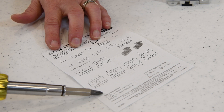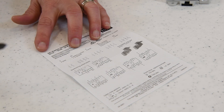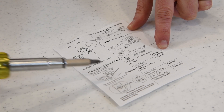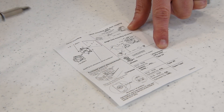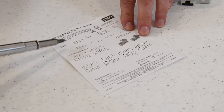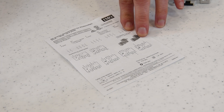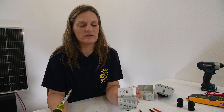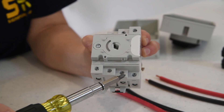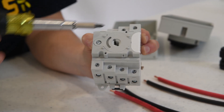You've got the cable sizes that you're going to use and the tools that you're going to be using. On the back you have some different mounting options, things about your enclosure and the environmental ratings. This is the most important thing for us today — our wiring diagrams and how to wire it up with your switching examples. As we look at the switch, this looks like the pictures in the diagram where we see the numbers are opposite: one, two, three to four, five to six, seven to eight.